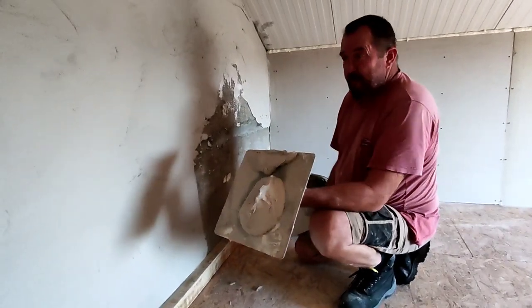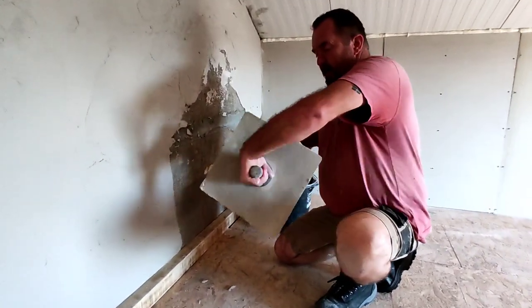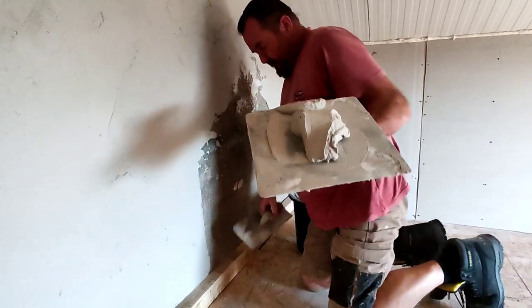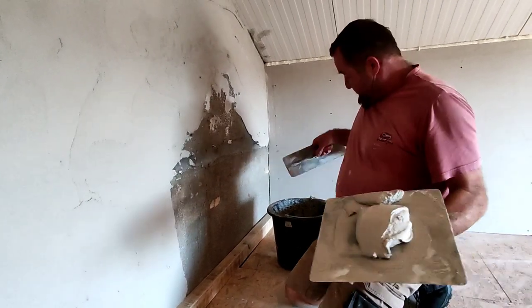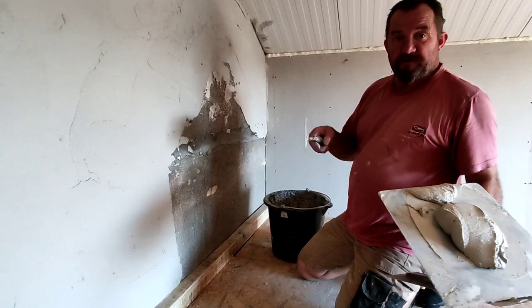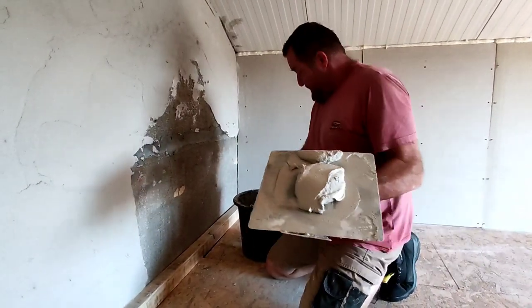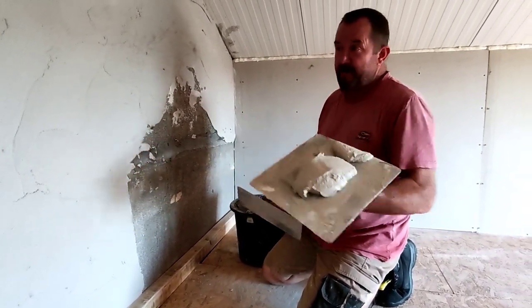I don't suppose I've said much about how to actually apply this and get it on the trowel, off the hawk, onto the trowel, etc. So, really quickly, scoop it out of the bucket with a bucket trowel or a cut off brickies trowel onto the hawk. As much as you can hold up would be handy, the less trips the better.